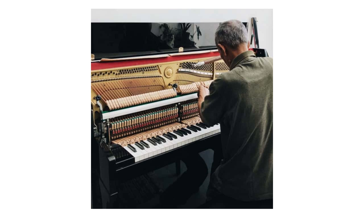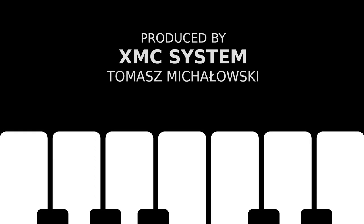When the key moves along each string in several circular movements alternately left and right, the tuner must account for all these physical phenomena to achieve correct pitch, ending with the correct movement of the key so that pin deformation and string relaxation do not affect tuning stability. To ensure the pitch of a given string remains constant over time, it is important to focus on precise and stable unison tuning. Each string in a bichord or trichord must have the same tension, with all string parts in a state of balanced relaxation. In everyday practice, we strive for the cleanest possible unisons, as they are the most stable.